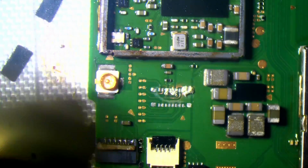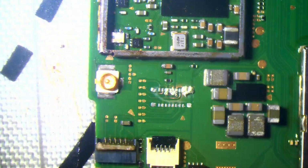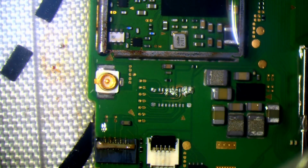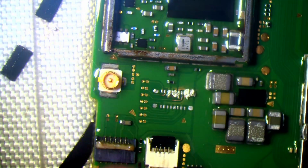A little trick, because you might notice that the bottom connector, the Joy-Con connector, is basically a little bit melted. One little trick is if you keep the airflow moving. I'm at 440 degrees Celsius right now, but if you keep the airflow moving, you shouldn't melt the connector. I'm not going to say you won't, because you will eventually, but you shouldn't melt it straight away. And that is pretty warm at the minute, and I want it warm because I need to make sure that I'm giving it a really good clean. I'm looking to clean this to a point where these connectors, when they're open, are moving around freely.